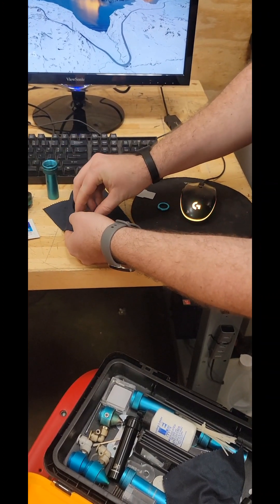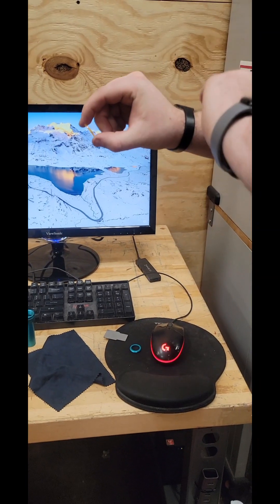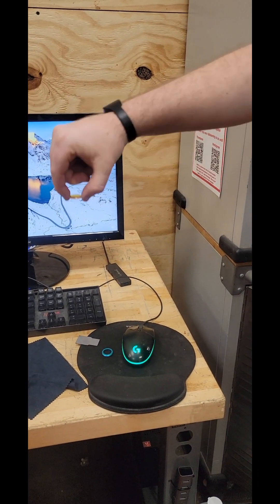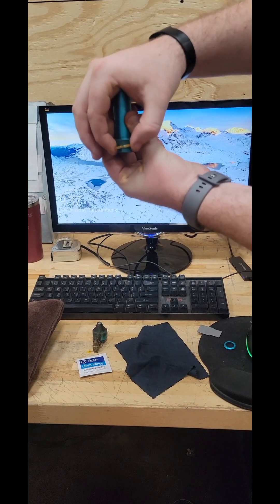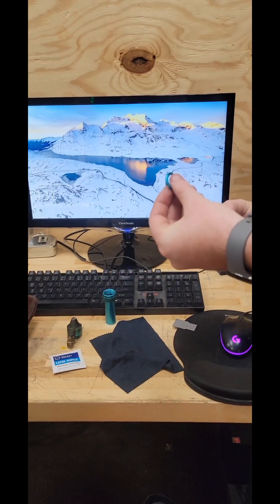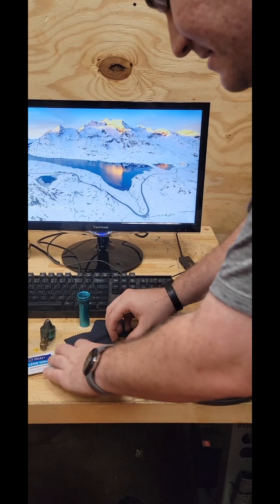And that is our lens. Since we're cleaning, I don't mind holding it. One thing to note: there are sides to the lens. There's a flat side and then a slightly curved side. When the lens is in the machine, curved side is always up. So when you're putting it back in, curved side will be down going in, curved side up once installed. It's kind of intuitive because when screwing this back on, if you were to put it in upside down, you'd start scratching the lens.